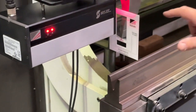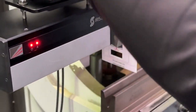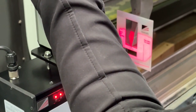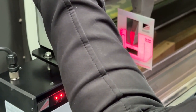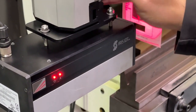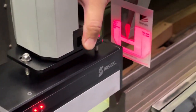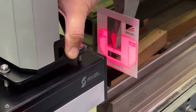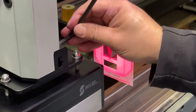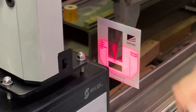The first adjustment is to get the laser inside the box at this end. Adjust the vertical position of the bracket — slide it down until the laser is sitting inside that box, lined up with the lower edge. Then adjust the plate: loosen it about half a turn, slide it back a bit, so the laser is sitting inside the red box. Once that's good, tighten it up, making sure not to over-tighten the screw for the mounting plate.